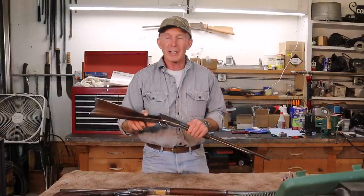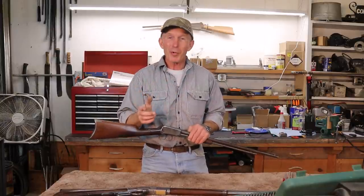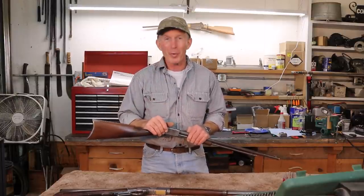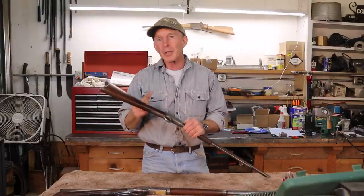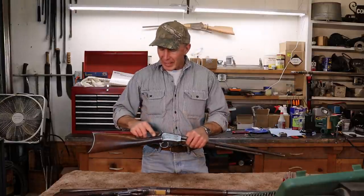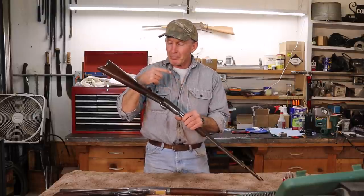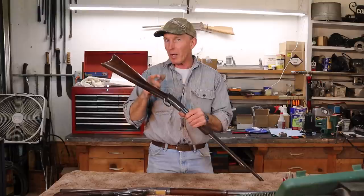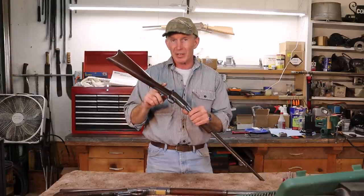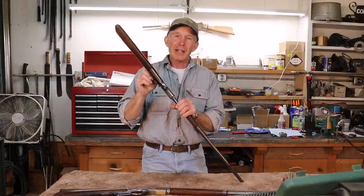Now the other thing I promised - a little about the stock repair on this 1890. I did try to do a whole episode on it and filmed the whole thing, but I lost some footage and audio trying new filming equipment, so we'll do a comprehensive stock repair episode later. This one was interesting because the owner really wanted to save the original finish. There was a crack all the way down the tang channel - it didn't come in two pieces so it was really hard to clean out, and there was old glue in there from a previous repair attempt which makes it really difficult. We had to pry this crack open as far as we could, then use a syringe and clean it out with acetone as best we could.